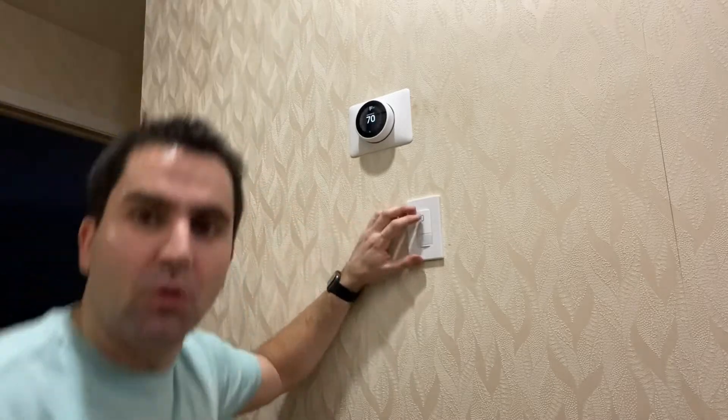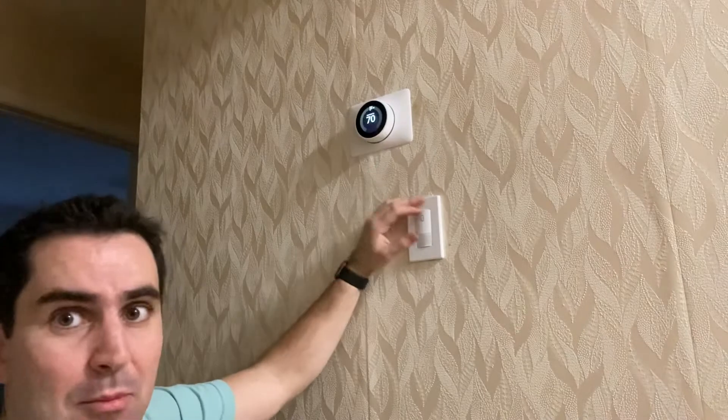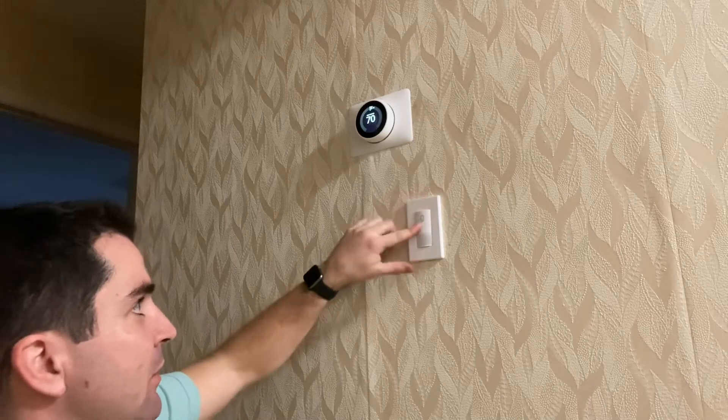I have it on manual on and auto off. You can override — I can turn the light off and it doesn't change any of the settings at all, which is one of the things I really like about this switch. That's how you install a motion sensor light switch without having any ground in the wall. The advantage is I can leverage the metal electrical box that's behind the light switch.